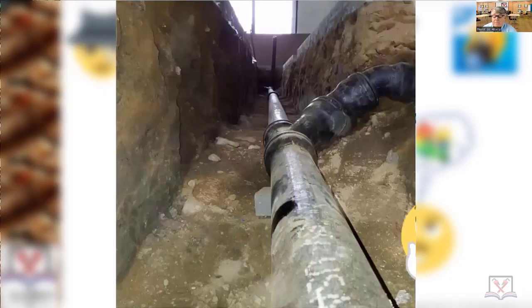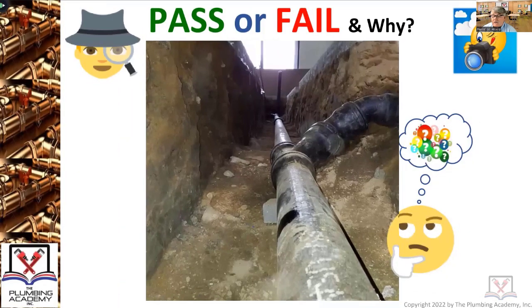On this same job, taking a shot down the pipe — the plumber and excavation contractor are not communicating. They just dug the trench at one uniform level and said 'put it on blocks and backfill.' That's one of the reasons why you see an extensive amount of questions out of section 1005 on trenching, tunneling, and backfilling — because plumbers can't do it, just as much as they can't size gas piping. Absolutely ridiculous.